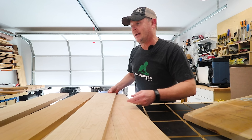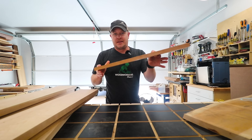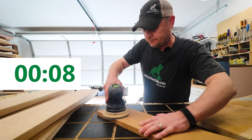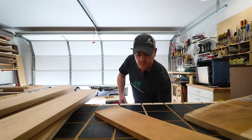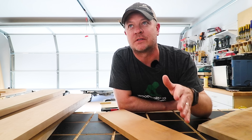The darker boards look better, right? I totally agree, but I hate to tell you — you're probably in for a shocker once you start working with those boards. Once you start cutting and sanding them, I just removed seven months of color like that. So when it comes to picking out your lumber, look for the boards with the grain that speaks to you, or the sizes that work for your project, or where the sapwood is located. I wouldn't worry so much about the different shades of heartwood. I know it seems backwards, but it's all going to work out.